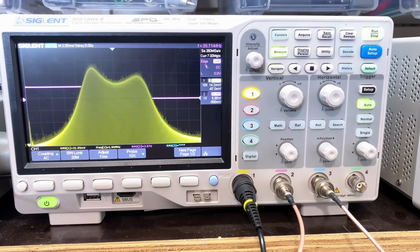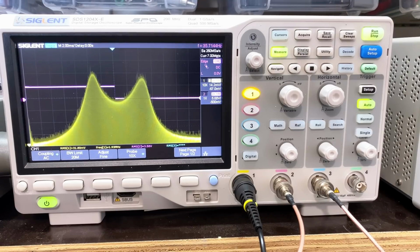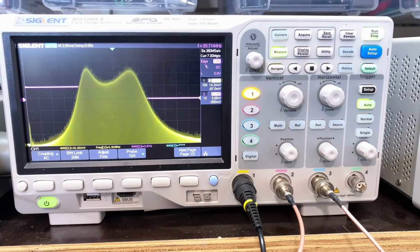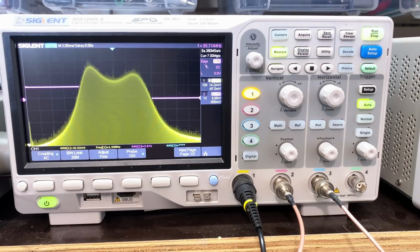Well, I'm going to go and do that one at the bottom there for maximum. I'm not even going to show you. It's pretty obvious. Let's see what happens when I... Okay, so this does roll the curve a bit, which means that's a maximum there. But if I go back to this one and this is the previous one. Remember, it was flattening out a bit, but it was rolling over. I'm doing the two together. Previous and this one. See, that rolls over. I want it there. Going back to the previous one to see if I can't minimize the dip to make the pass band as flat as possible.